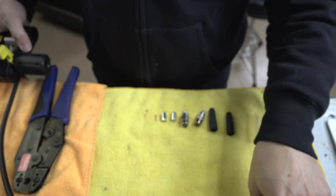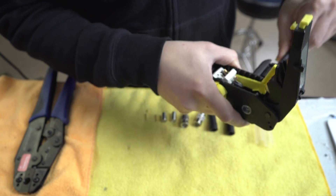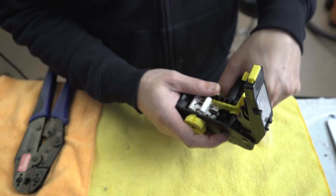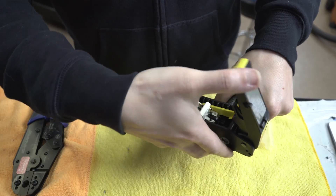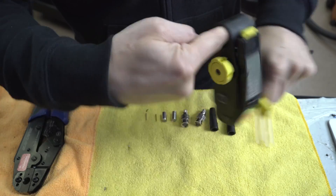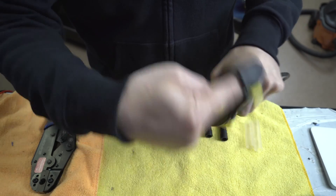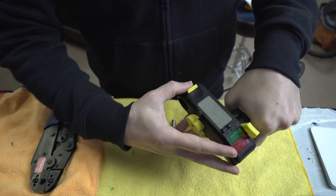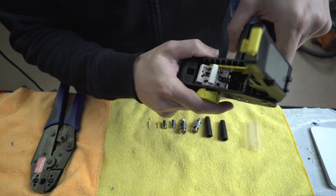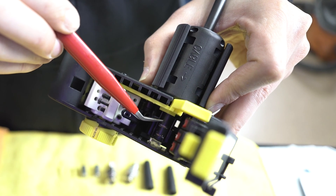Let's start by stripping the cable. What you do is you stick the cable in here like this and you just twist it until it hits — there's a little window right here. Once it's in there, you grab this part right here, this has little fingers that lock the cable in place, and then you push this down until it clicks. Then while gripping this, stick your finger in here and just twist it a few times. You can feel it kind of bite, and then I like to go the other way just one or two times just to make sure. Once it's done while you're holding it with this hand, there's a little yellow button right here, just click this and it opens. Looking inside here, you can see that the cable is cut right here at the top, right there in the middle, and then here at the end.